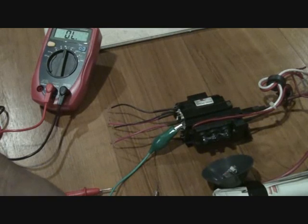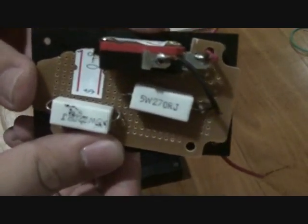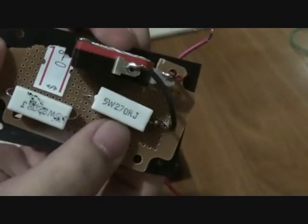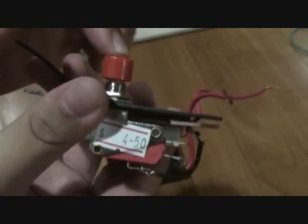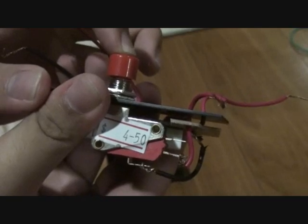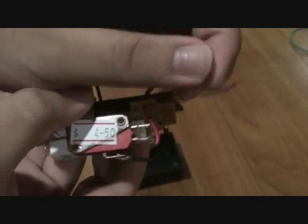That's how you find which pins are what. This is my very simple resistor and switch box for my flyback transformer driver. We have two resistors — a 220 ohm which is R2, and a 270 ohm which is R1. Your high voltage flows in from here through a dead man switch, a momentary switch that only works as long as you press it. This is your primary voltage in at 6 volts, and this is the out toward the primary coils on the flyback.